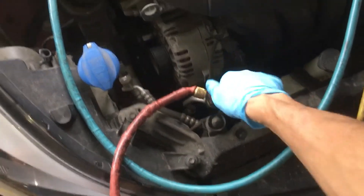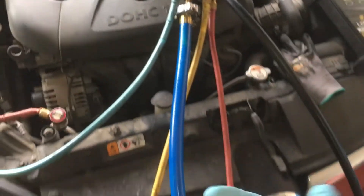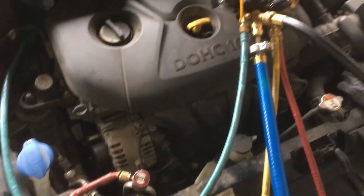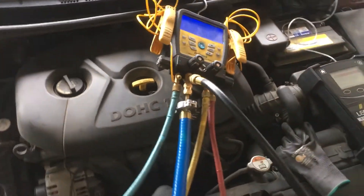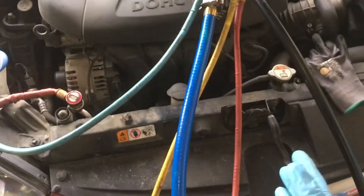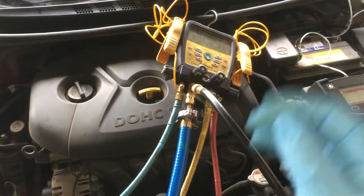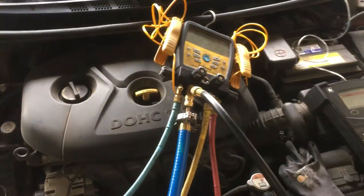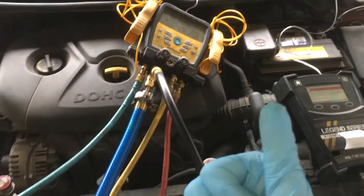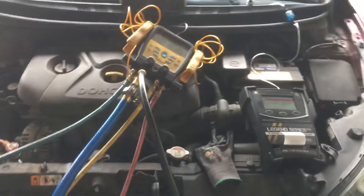Now it's time to move to the dry nitrogen. I'm going to go grab my tank of dry nitrogen. There'll be a third video while I go hook up the dry nitrogen and jump to the next test, because there's no visible leak and it's at zero. Is it zero because there's a really big gushing leak? I'll find that out right away without refrigerant by using dry nitrogen — let's see what happens.